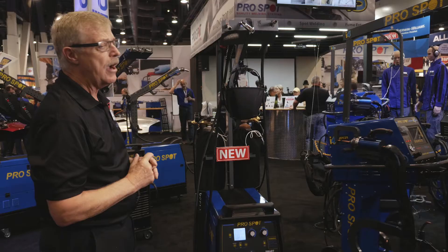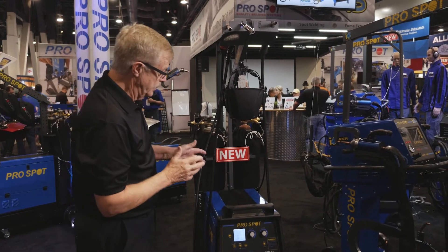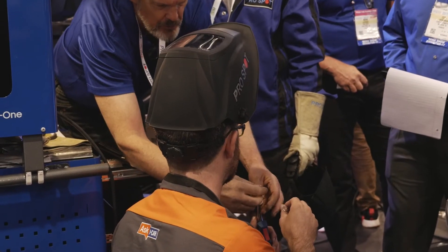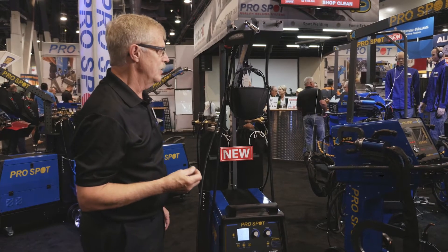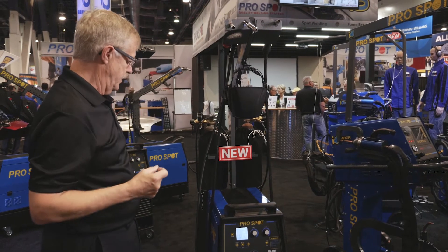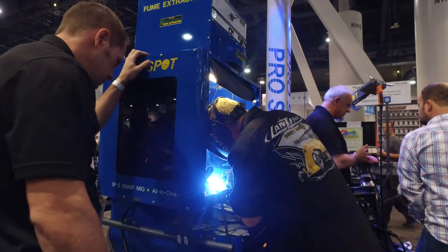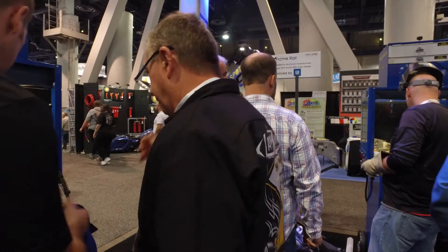This year what we've done is we are now introducing double pulse technology into the single phase SP5. Double pulse and aluminum is really going to assist the tech in day-to-day because it's a super controller of heat. We limit the amount of heat going into the aluminum. The range of welding that we can do is much better than before, and it gives the tech absolute control of the arc while welding, making it so much simpler to weld on those ultra-thin materials.